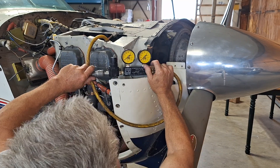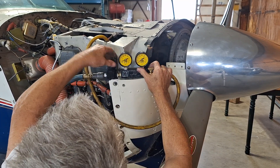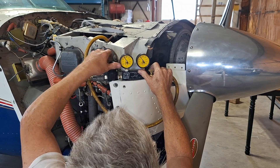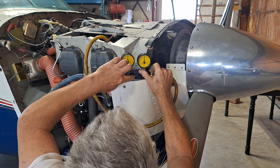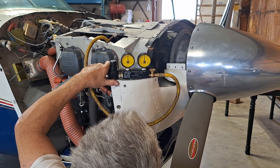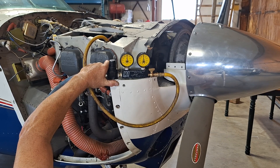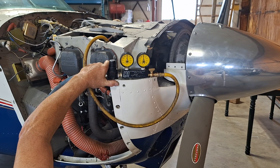I'm going to hold that with my stomach and hook up the gauge, and increase the pressure on the left side until it's got some tension, then move the propeller down a little further to hold it. Bring it up to 80 pounds on the left gauge — there's an orifice in here that restricts the amount of flow going into the cylinder so you can get a relationship on the gauge. I'm just about at top dead center and it's 80 over 80, so it's really about 80 over 78 on this cylinder right now.